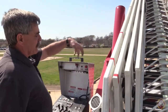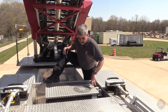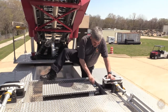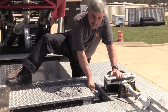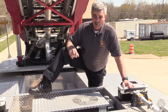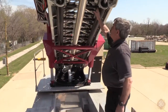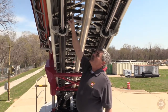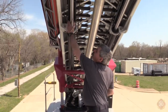Normally we would rotate the nozzle left, right, up, down, and try it for fog and straight stream. But we have a gen set up here that runs on hydraulic power. Hydraulic oil goes in here — this is a visual where you have to look at it — and it's literally running all of the time. You have a switch on the dash that says 'excite the generator,' which closes the field and makes electrical current, but this is running all of the time. Just tap your cables — don't run your hands up them — and look for frays, look for leaks, and look for any fluid.